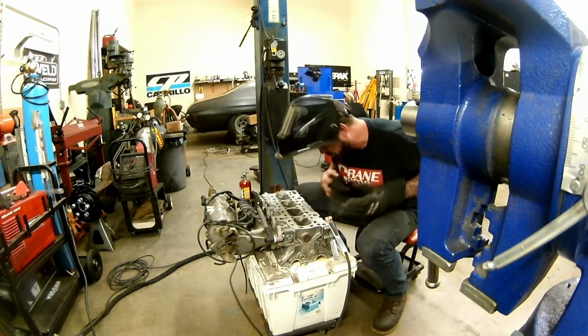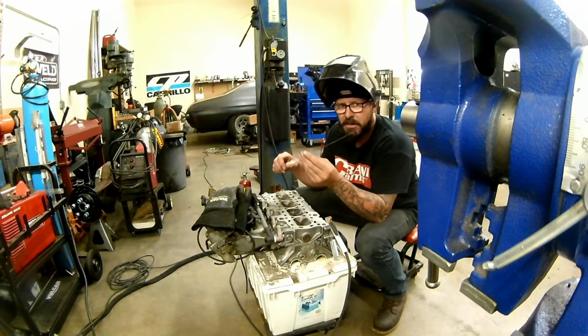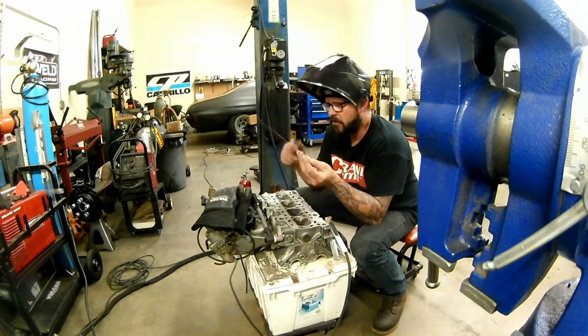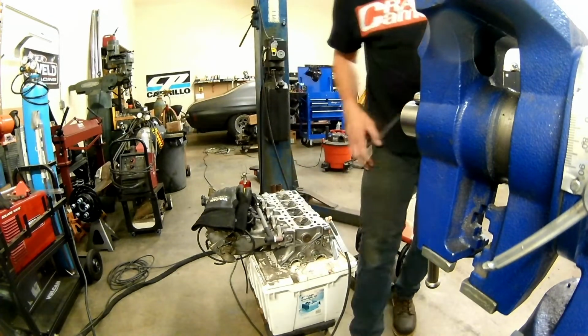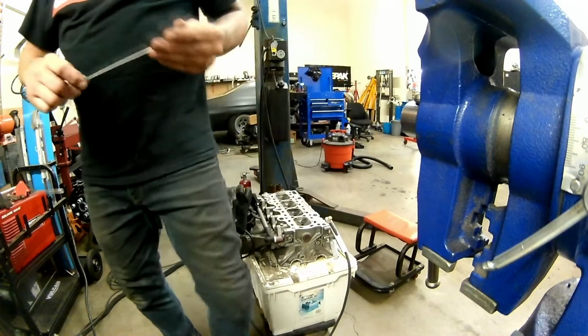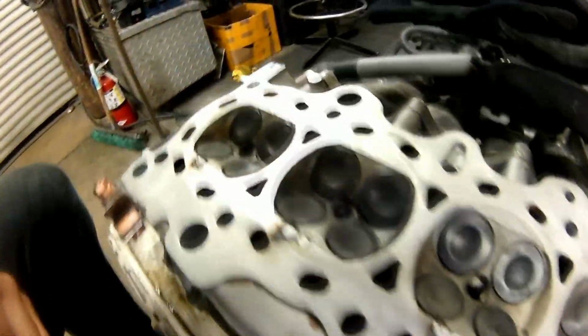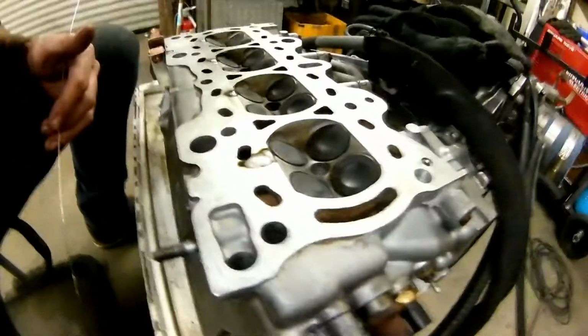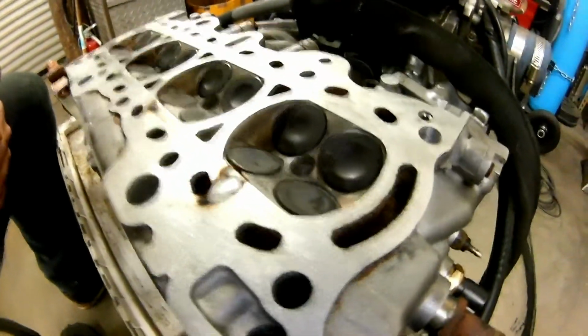Very happy how it turned out. Very minor cleanup. We're running .035 rod for aluminum, so about 160 amps. We never even got past probably a little over quarter throttle, and it's very dirty, but at least we have some material to use. I'm going to go ahead and start sanding it slowly and getting the straight edge out and getting this to work as best as possible, because I'm pretty happy with that, and I think that's going to work really well.